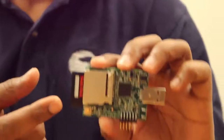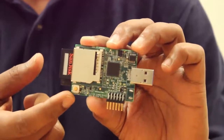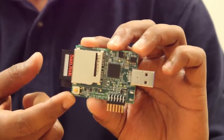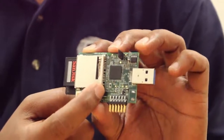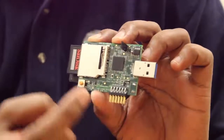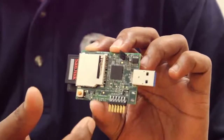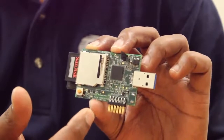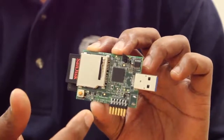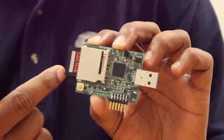Now let's examine the kit. This here is the FX3S RAID boot disk kit. This kit is made by Pactron and is available for purchase from their website at pactronstore.com. As you can see, the kit has the FX3S RAID-on-chip controller, a super speed USB connector, an SPI flash that is used for booting FX3S, a 10-pin connector that has a UART interface for debug, and a slave MMC interface that can be used to connect to a board management controller.